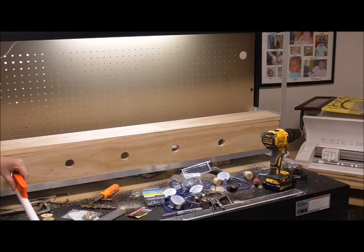Do they lay on the bottom of the hole or center them? Yeah, they lay on the bottom. I got a suggestion. If you've got enough pipe to work with, I'd cut a piece about where your hand's at as a guide, and put one of them inserts in the end of it, and put a mark, even a drill bit, in that hole, and you put it through and level it, and you mark your hole across the back.